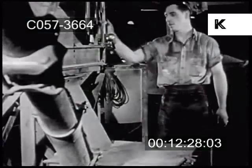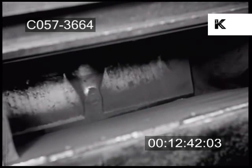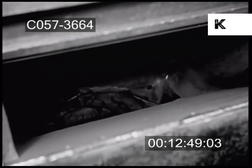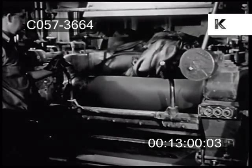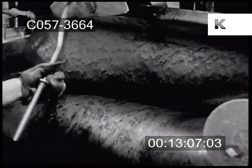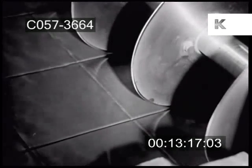All ingredients are finely ground and put into the mixer to be carefully combined under heat with the powdered shellac, which is sucked into the machine through a vacuum pipe. Now all is ready and the Banbury mixer rolls. Inside this huge machine, three stories tall, the mixture is heated to the melting point, whipped and stirred and beaten until it is thoroughly mixed to a dough-like consistency. The hot mixture falls out on great rollers where it is kneaded and rolled into a long flat sheet. As it comes out of the machine, circular knives cut it into pieces called biscuits, each the right size to make one record.